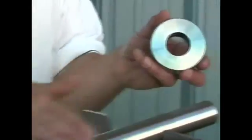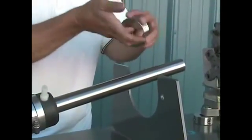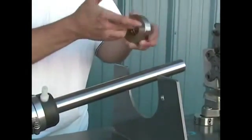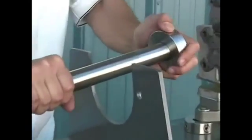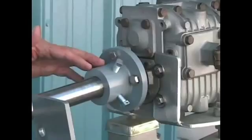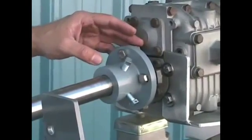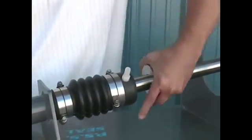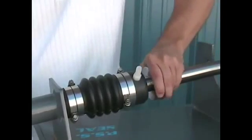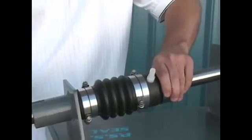At this point you're going to want to put some soapy water on the shaft and on the O-rings to help lubricate them and facilitate sliding the rotor down the shaft. Once the shaft coupling is back on the shaft, bolt the couplings back together again, then slide the stainless steel rotor the rest of the way down the shaft until the stainless collar just touches the carbon face.